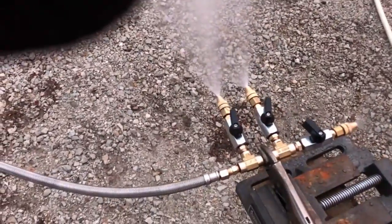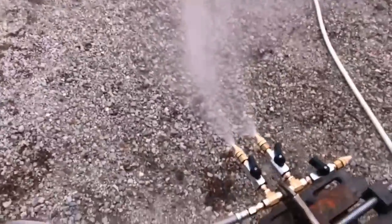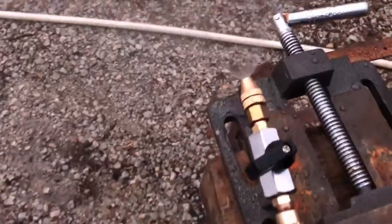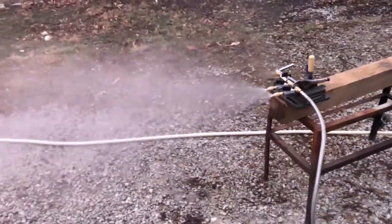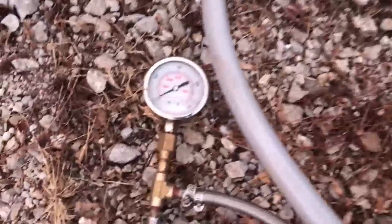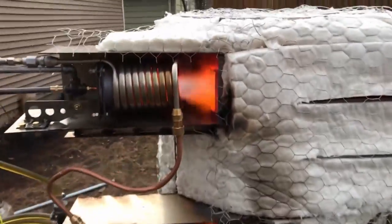This right here is a spray nozzle array. These are just the valves that will be connected to the nozzles, which will be placed remotely inside a flash dryer I'm building. We're spraying about 54 to 60 gallons per hour, and we've got this thing set on number 40 — that's important because when we get to the job site in Kentucky, we're going to want to look at these very same operating parameters.